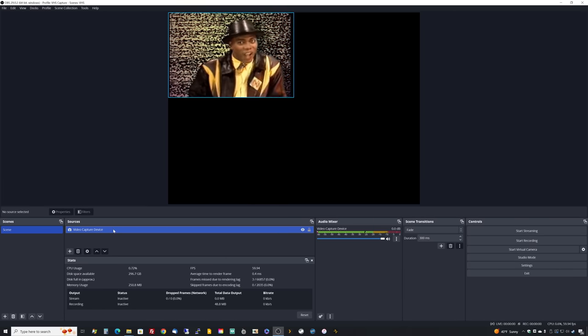I've left links on how to clean VCR heads in this video's description. If that doesn't help, you might need a piece of hardware that enforces good timing signals called a time-based corrector, or TBC. Many SVHS decks come with one built-in, or you can get a standalone TBC unit and put it between the VCR and the capture device. Unfortunately, both options cost a lot of money and are out of scope for this beginner's tutorial.